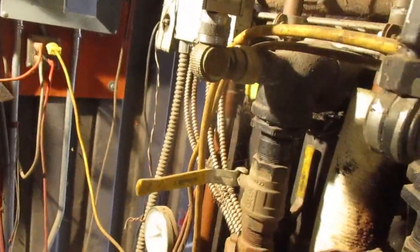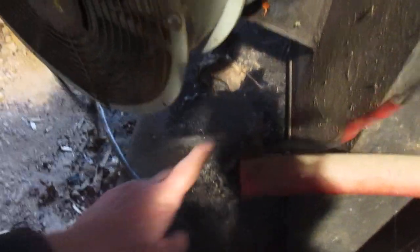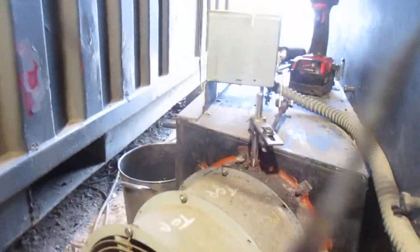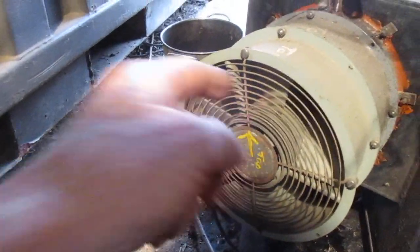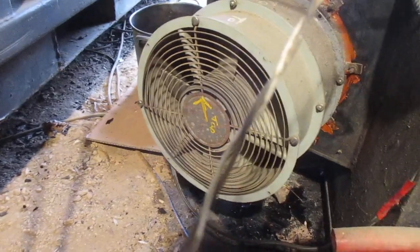The house is plenty warm. I'm controlling it through that — we're sitting at 174 degrees in there on that little bit of wood. It doesn't take much to heat this boiler up. This gives you a little better view of what's going on back here. You can see down here where all this crud is dripping. If it drips and gets onto this baffle — this baffle here goes all the way open, swings wide open when the fan comes on. It had a little bit of crud on it but feels pretty snappy like it's closing good now. I'm going to clean it up a little bit more. I have the fan off, the whole unit turned off.